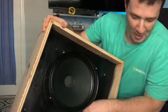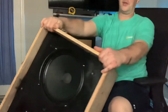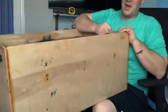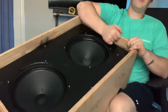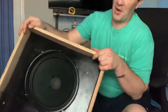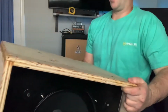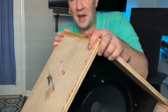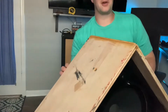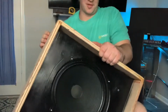I didn't want to skimp on the speakers. I was looking into Warehouse guitar speakers. I knew I wanted to put at least a Vintage 30 in this cab, and in the end I went with one Vintage 30 and one Celestion CreamBack H, because I figured if I make a two-speaker cabinet, I can wire them in parallel for an 8 ohm load, and I can blend two different speakers together for a more well-balanced, nicer guitar tone instead of just putting two Vintage 30s in here.